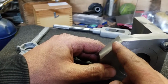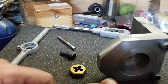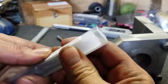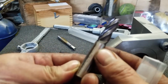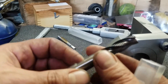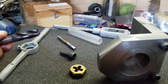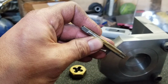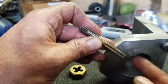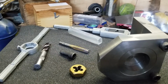So in any case, now what I gotta do is line up some holes here and put a little flat spot there. I might try on that other piece first, see how that works out, because it's kind of similar. I got these 8% M42 cobalt fancy roughing end mills. I got a 1/2 inch one, so it should fit in my drill press, and hopefully it's just enough to give it a little bit of a kiss there and flatten it out. Then I can punch it, drill it to 5/16, and run a tap partial of the way down. Then the pins will be the rest of the way. The bolt will push in, push the pin to lock the dovetail, and Bob's your uncle. That's the plan. Let me get set up here, and we'll see what happens.